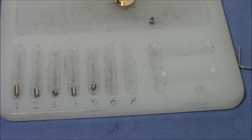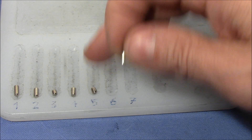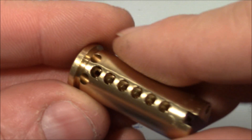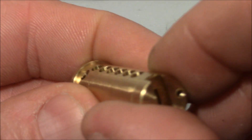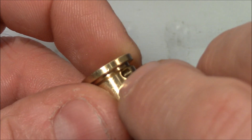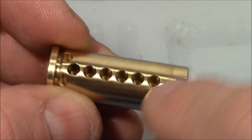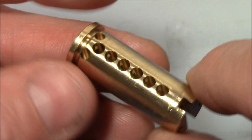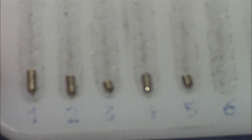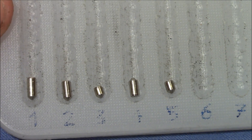Let me check the pin material with a magnet. No — that's not steel. That's maybe brass with a coating. Let's check the plug really closely. We can see it is extremely well made, very smooth, with no flattening on the top. On the shear line it has the option for anti-drill pins — hardened steel inserts — but this lock is not equipped with that feature. It also has the capability for a sixth pin to make it a little bit more secure. Nothing more to say about the plug and key pins — smooth key pins with no special features.